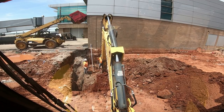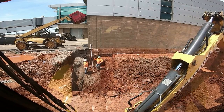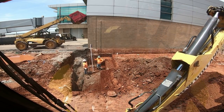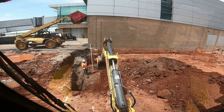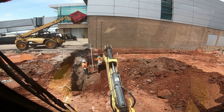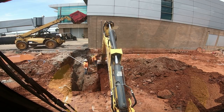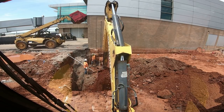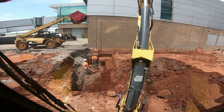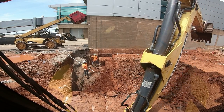This is a 30 inch bucket, so I just gauge off of the teeth. That one's about 6 inches to the center, to the edge. So this kind of makes it easy to gauge about how wide you are there. Teeth are about 6 inches apart, so if you go two teeth, the first tooth is zero, but the second tooth would be six, and the third a foot.